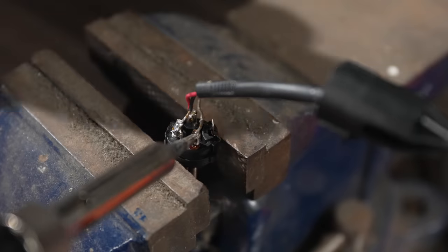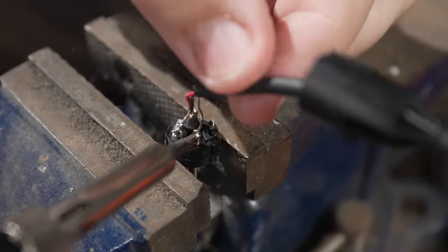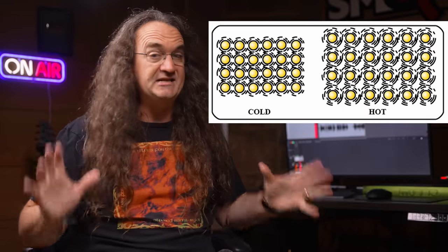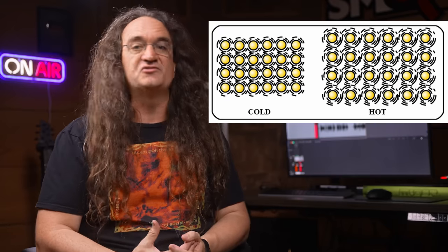Be sure to heat the two items you want to bond, put a little bit of solder on the joint, remove the iron and let the connection cool, then tug on it to make sure you've made a proper connection. We're trying to bond the items on a molecular level, so we need to get those molecules moving. As they cool, they slow down and the two pieces lock together. Once you've made your connection, never ever hold the soldering iron up and admire your work.